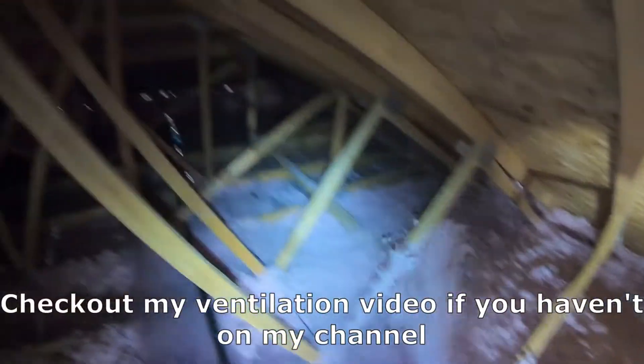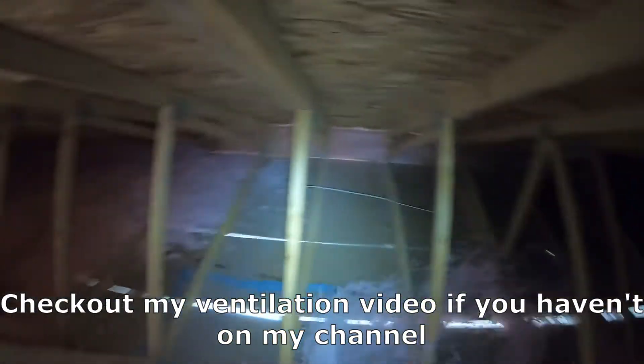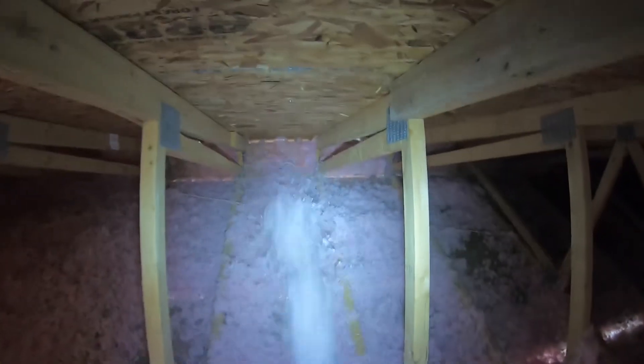The R40 is 14.6 inches for Owens Corning fiberglass. You always want to look for these two-by-fours and insulate under them before you move on — very, very important — like this, right around the attic hatch.